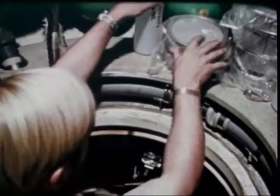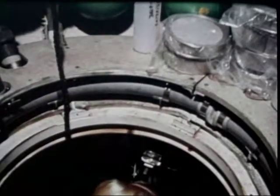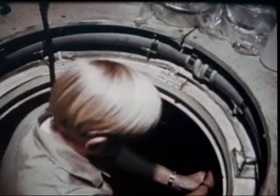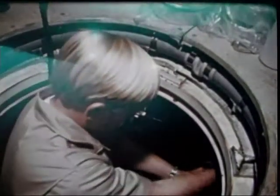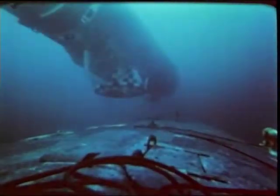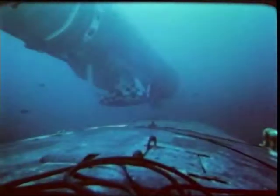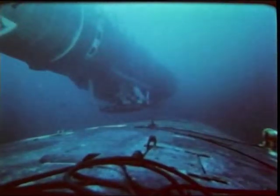For the first rescue trip, life support supplies must be replaced, batteries recharged, etc. Crew substitutions can also be made. The mission moves into the rescue phase, and the DSRV returns to the disabled submarine for mating. The final approach to the submarine is made with the shock mitigation ring lowered. The DSRV hull withstands an impact up to 85 one-hundredths of a foot per second, but the shock mitigation assembly withstands impact up to 2 feet per second.